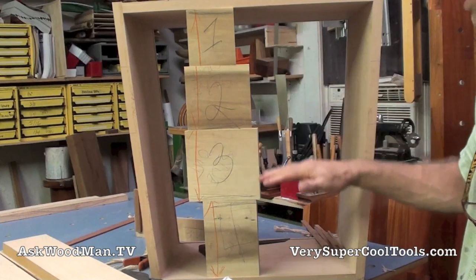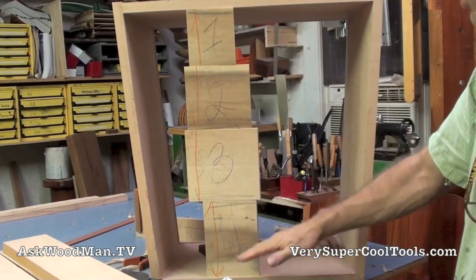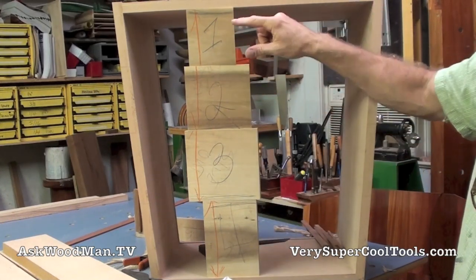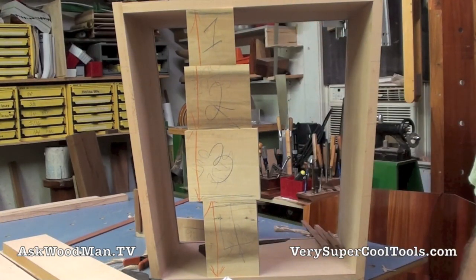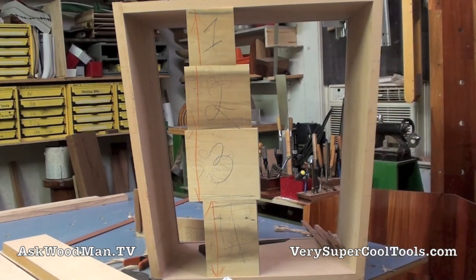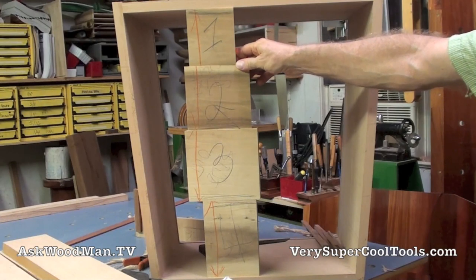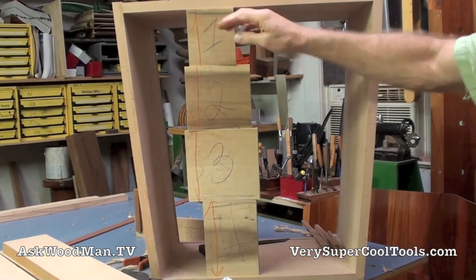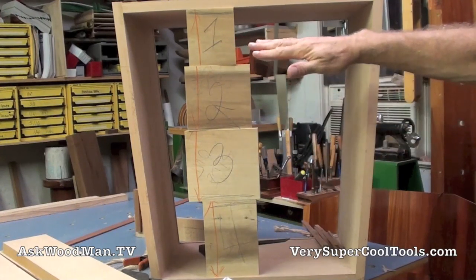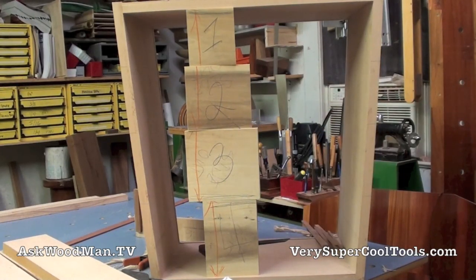I want to show you a couple of calculation techniques. You can either set the top drawer and figure out your spacing, or figure out what spacing you want and then drive the drawers to that — keeping everything nice and doing it quickly. I calculated these, took these scraps, cut them — they're beveled at my proper five degree angle. I haven't introduced the reveals yet; I'll do that after I get my drawers roughed out, probably with about a millimeter and a half in between each one. But I'm doing an exact calculation right now, and here's all my drawer stock ready to get milled up.